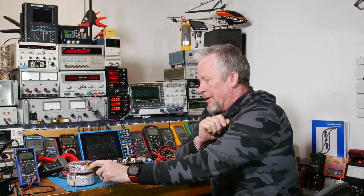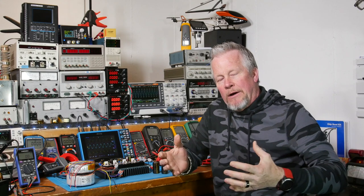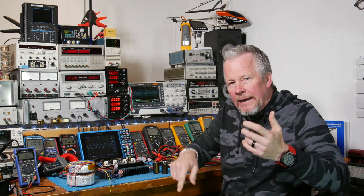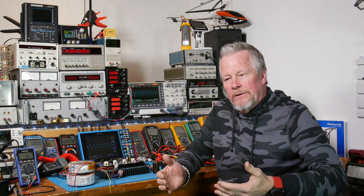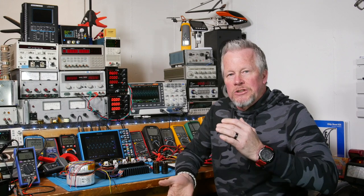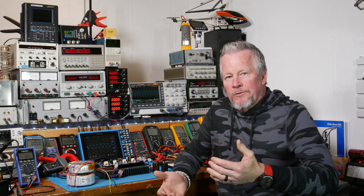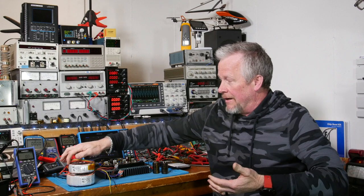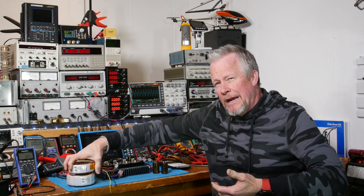The advantage of going to a bigger transformer is we've got more volts, more power — but the disadvantage is we have more power to dissipate because we can't use it. Some amplifiers can swing higher but might burn up. This amp, it's like it has a governor on it — that input section will only allow us to get 20 watts, after that it just clips. It doesn't matter if you've got plus or minus 60 volt rails, it's not going to use it. So it's useless headroom.